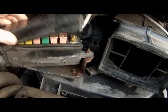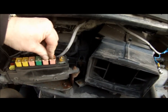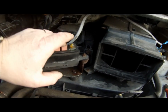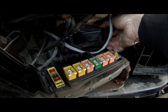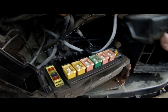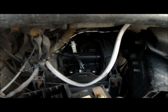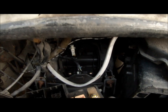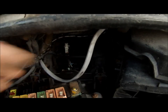I don't know what the end one is, but we'll ignore that. Counting across — it's one of those two. One's the heater, one's the fan. Both of those checked out fine. So the next usual problem is on the ones with air conditioning, there is a transistor circuit. You've got two screws there — take the transistor module out. I checked the transistor, worked fine. I'll do another video inside of the actual transistor module. So it's just those two screws — that connector comes off and that unit lifts out.